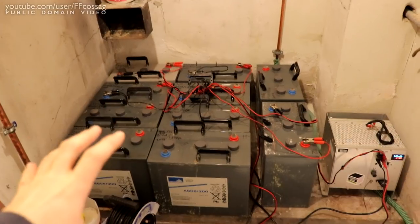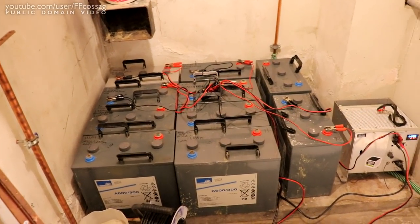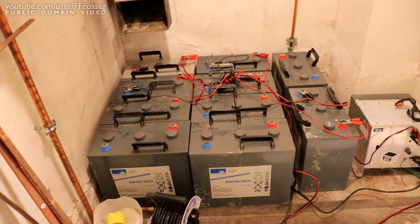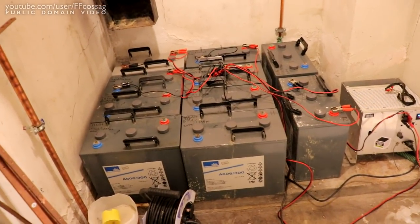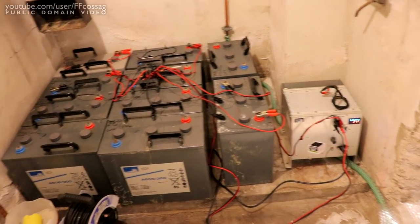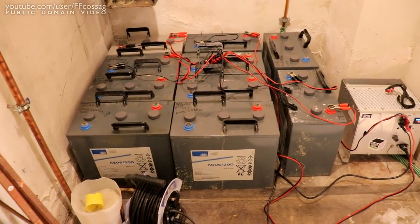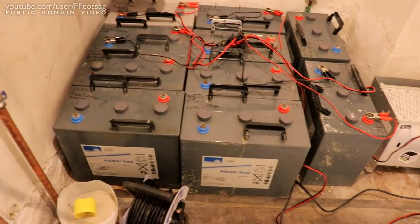As for the old bank, I've brought all of these Sunstone six-volt batteries that I've completely neglected — I got these in late 2015, they've just been sitting around. I charged them a couple of times and they've dropped down to about 6.2 volts per block, which is super frustrating. I'm charging them up though, and they seem to have taken kindly to sitting. I think we can get a 200-amp string out of them — maybe one 48 volt string if we're lucky.